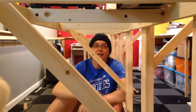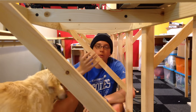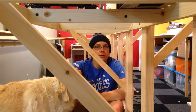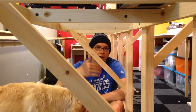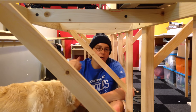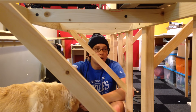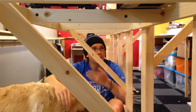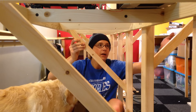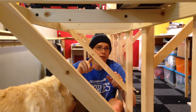As you can see, we just got these angled braces in. On this side I only did three — there's one behind me, one right here, and one right in front of you guys. What we eventually want to do is drop a couple legs in between these, so that's why I offset them. I skipped every vertical stud, so the one there is actually two studs away from this one, and so on. On the other side, I actually offset it — that side is only a 12-inch shelf, whereas this is 17-inch, and it's also higher. Those angled braces are on the vertical studs that don't have these angled braces on them.